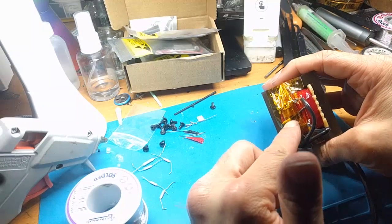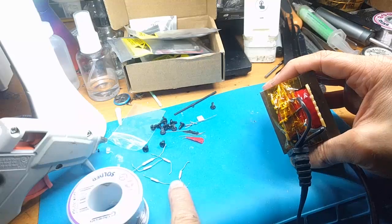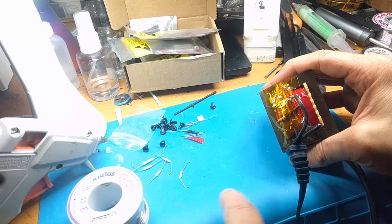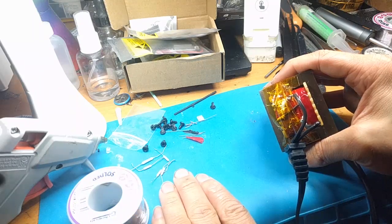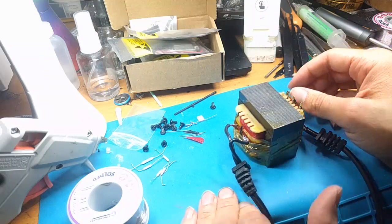So how did I find a thermal fuse? Can anyone guess where these are from? I'll give it a second for the regular viewers. These are from the backlight to a Sega Game Gear. Same deal, high voltage, AC, and so they need a thermal fuse. Pretty cool, huh? So I have a bunch of those in my parts bin, because I'm always working on Game Gears.